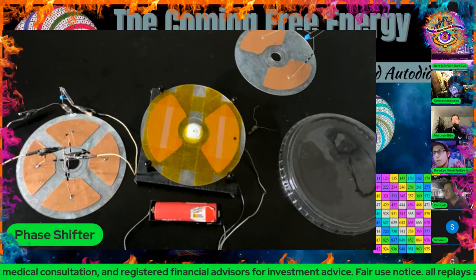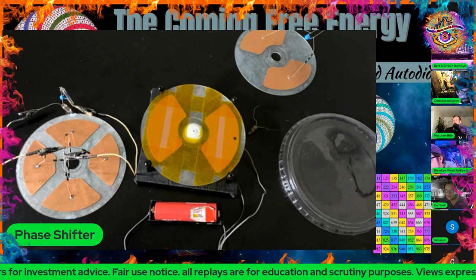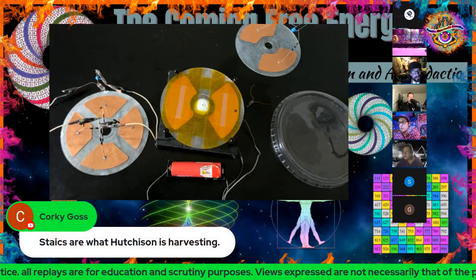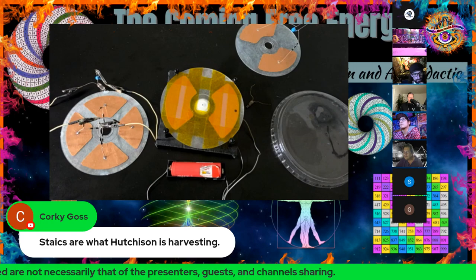And a whole bunch of people ask what kind of diode that is, Jeremiah. Sorry. This diode is called the 2CL71, and you can buy it on eBay and Amazon. It's rated for 8 kilovolts at 5 milliamps. It's one of many 2C series diodes produced in China.